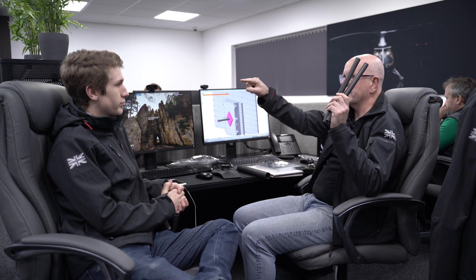The next step is to go and do a dynamic test to sign them off. If these behave as planned, we get a lovely flat force-displacement curve sitting nicely at 20G, then we'll be very happy — that would be ideal. But we're still testing, so even if it's a little bit high or a bit low, we can adjust that by just tuning the wall thickness of the tube.